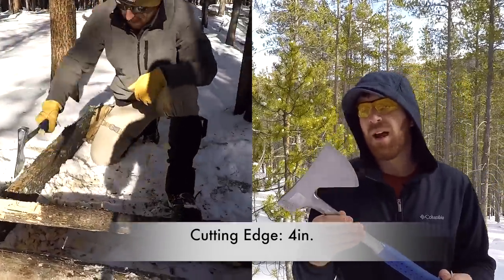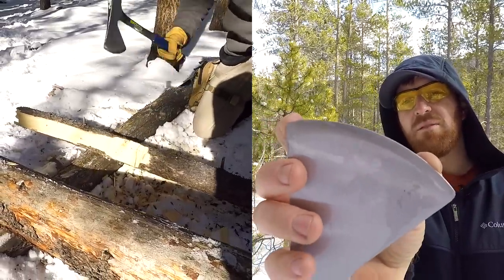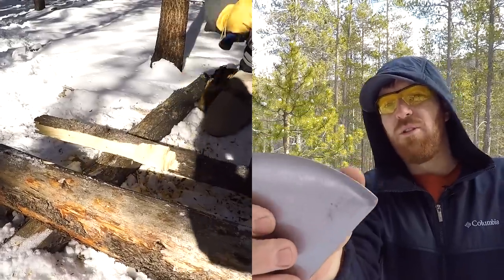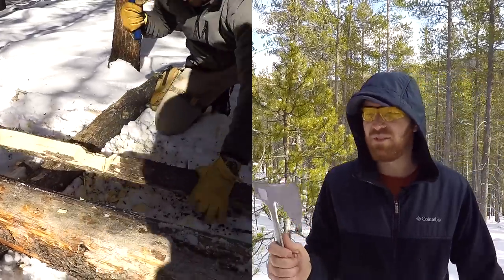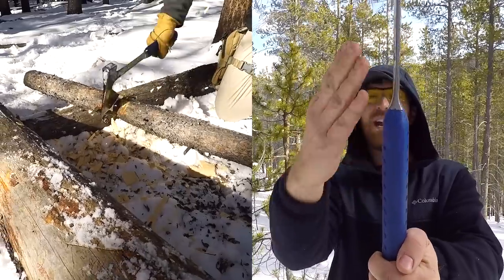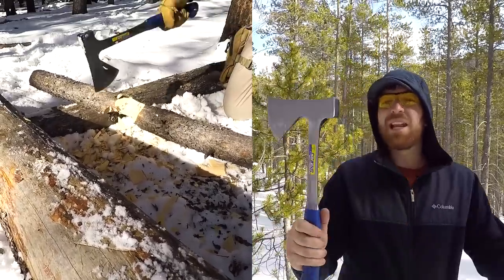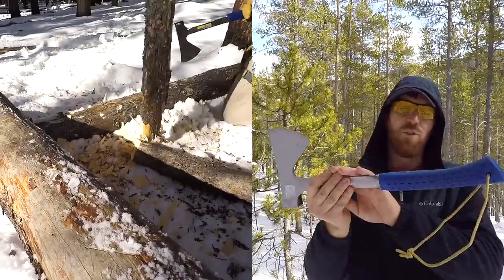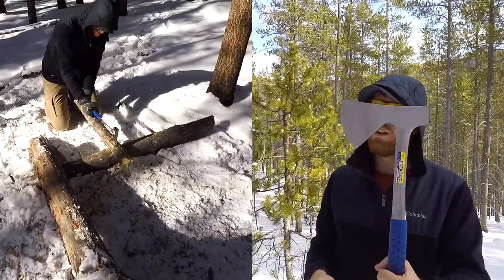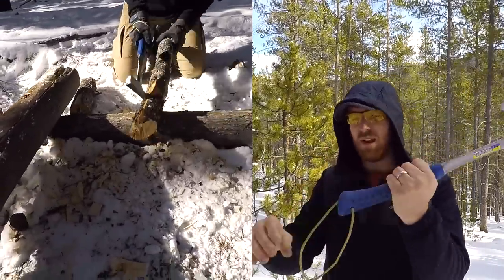I was really impressed with how deep it went in and the convex grinding they're doing. Now, as a budget-friendly item, I noticed they only ground the blade about three-fourths of the way — there's about an inch right here where my thumb is that has no bevel at all. It's an easy fix since 1055 steel is easy to work with, but it's a fit-and-finish thing. Down near the neck where the handle flares out, one side has a narrower swell and the other is more abrupt — again not a huge deal, but noticeable. The full-tang design with a rubberized handle really helps with shock absorption while swinging, and it stays in your hand really well. You can even dual-wield it with two hands.